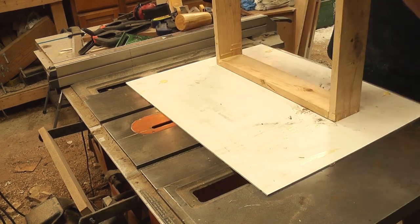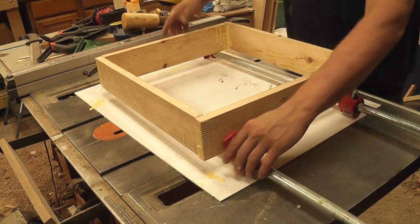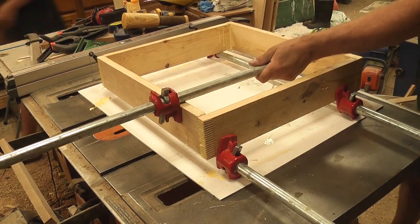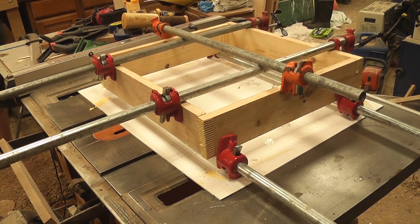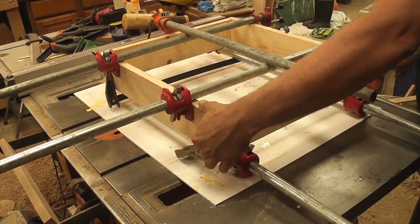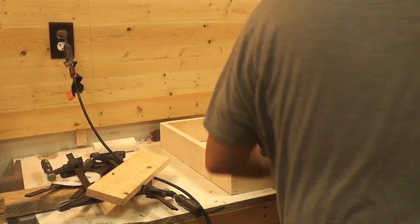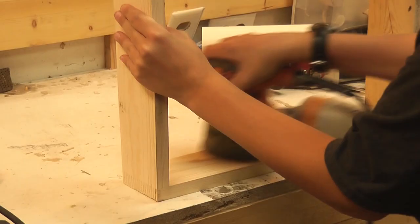Now, before I cut into the wall, I really wanted to make sure that the box I was inserting would match the carefully drawn lines I had already placed on the wall. Building the box first made a perfect pattern to double-check my lines. That's important because with the natural board patterns, repairing any mistakes would make the repairs stand out and not follow the natural look of the wall.